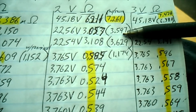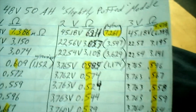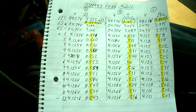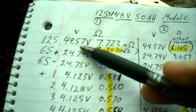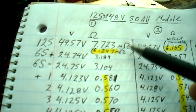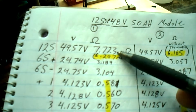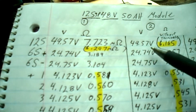For these larger pack readings — the ones not on individual cells — they didn't bounce around at all; they were pretty well settled. Here's our data for the standard module that hasn't been over-discharged or slightly puffed. This battery was fully charged so it was 49.57 volts. Checking off the terminals gave a higher ohm reading than right off the cells themselves. The voltage is real consistent on all of them.